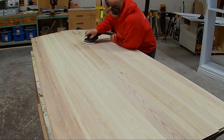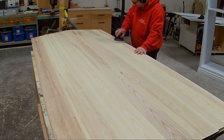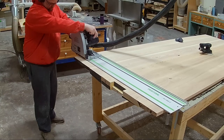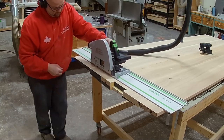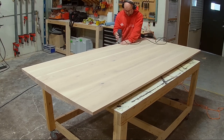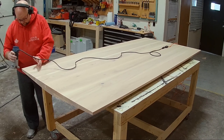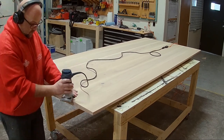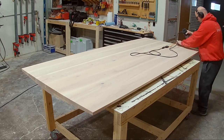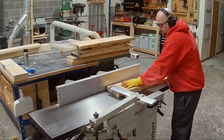After the glue-up I moved on to the sanding process, working through the grits — starting at 60 grit, then up to 120 grit on the underside, and 180 grit on the top side. After that I take off the rough edge by running the router over it to give a nice smooth one-eighth-inch roundover. I find it works really nicely on modern furniture.